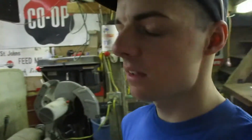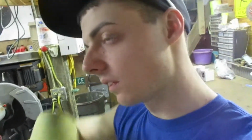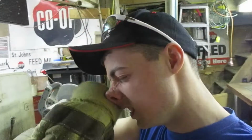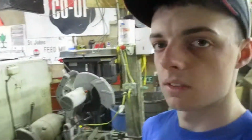I think two will be better than none. So I can't get any on that back side. So hopefully this will elevate the front. That's kind of why we have the extra length, is so we can pick up the front a little bit. Now it might get crap in there and underneath, but also the water needs to drain because there's no PVC pipe coming out of the bottom of the drain hole. So need a little bit of gravity so it won't build up there. So I think this will work out great. I'm gonna go get my drill and we'll start drilling.